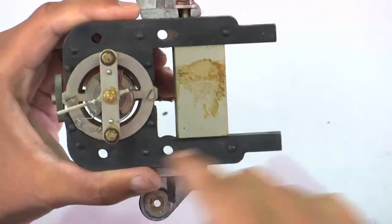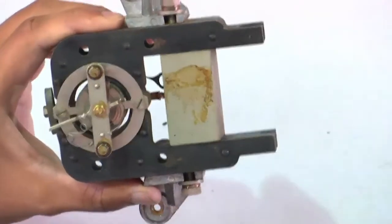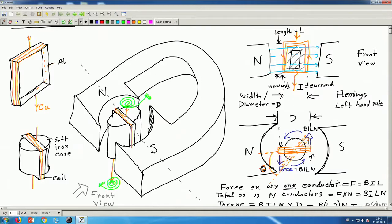This black thing is actually just a piece of soft iron. If we refer to our diagram on screen, we have here a permanent magnet — only this part is the magnet, and these black parts are not the magnet. This is only iron — a piece of iron which guides the flux lines from this magnet through this coil. It is a guide for the magnetic flux lines; the actual magnet is only here, but this iron acts as an extension to the magnet.